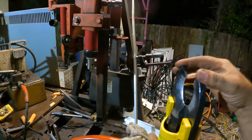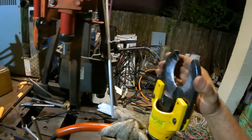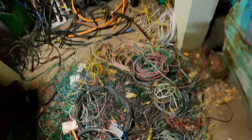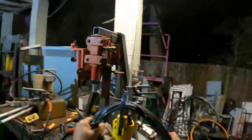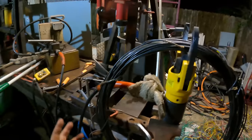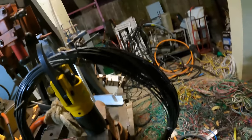All right. Well, I'm a little disappointed in the play that's in it, but for the $150 I paid for this thing, you know, what do you expect? I'll sit there and modify this thing until I get to cut these spools. That's what I originally wanted to do. Originally I would cut spools like this. I'd grab it and just hold it in my hand and keep feeding it every half inch, boom, boom, boom, into that, and cut this spool down pretty quick so I could just feed it. And while I'm cutting that, I'm grabbing handfuls down here, throw it into the granulator, listening to the granulator, keeping it going at its pace. I can cut this up faster than the granulator would actually chop it up.